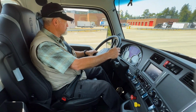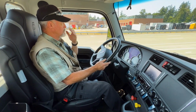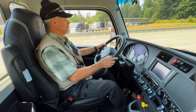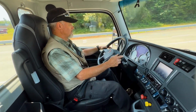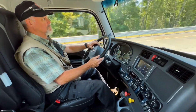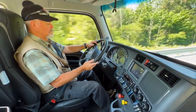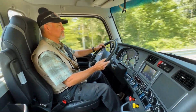As you can notice right from the jump, this truck has a lot of power and quick acceleration. Much of that is due to the Meritor 14XE tandem e-axle. The motors are directly attached to the rear drive axles, giving it 536 horsepower and 1,623 foot-pounds of torque. Those motors being attached directly to the drive axles gives it peak efficiency and frees up space in between the frame rails for extra battery storage.